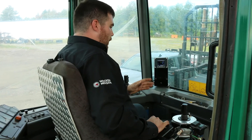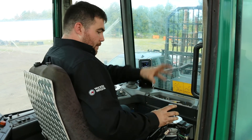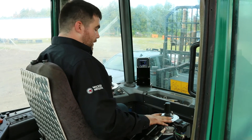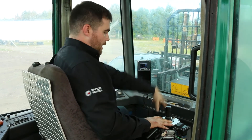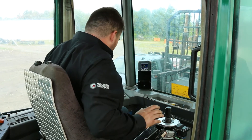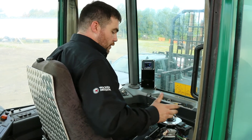This is a typical IPS box replacement on a 1010 Timber Jack that used to have the big mushroom head joysticks, now replaced with mini levers installed. The display and the IPS boxes were removed and we installed the cabin module. All the harnesses have been installed to the valve, and the seat and cabin harness for the joysticks are new as well.